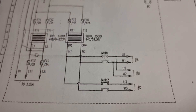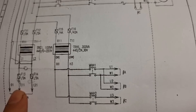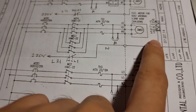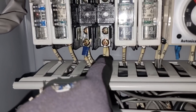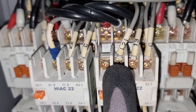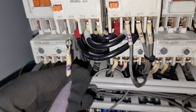The braking conductor for the electrical motor had wires connected to L21 and L11, going all the way to the output of the fuses. I removed those lines and checked the heater, because most of the time when we have an earth fault it is coming from the heater. I will now measure the resistance of L21 and the additional heater line.